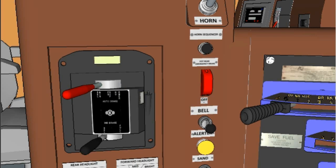Warning: Following an emergency brake application, if the train is not at rest, brake release must not be attempted. Any movement of the independent brake handle to Release (REL) while the train is moving may cause equipment damage and/or personal injury. Note: If operating as a lead unit, the electronic air brake system imposes a one-minute time delay before it is possible to recharge the brake pipe after an emergency brake application. This timer will start only after the locomotive speed has reached zero.